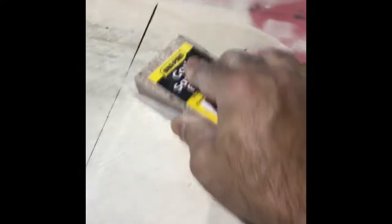Because it was set in a cold evening and probably with high humidity, I'm getting Amine Blush. This is what happens when you get it, and hopefully it will help you recognise it. Here I've got a new piece of sandpaper — it's about 240 grit — and I just wanted to scuff the surface getting it ready for primer. But this is what happens.